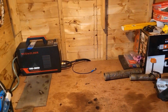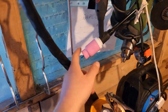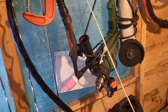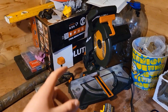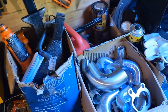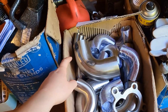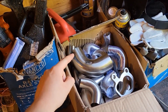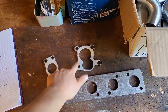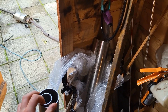All the work will either be done in the driveway or in this shed. We've got the welder, a size 12 cup with a nice fancy filter, a gas setup with a purge, and we'll probably be using the grinder and drill at some point to cut the stainless steel — I'm not buying a 700 euro bandsaw. In terms of material, here we have all the bends: 1D radius bends in 1.5 and 2.5 inch, and here are the flanges for the manifold — the one that goes onto the cylinder head, the turbo outlet, and the turbo inlet.